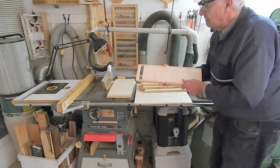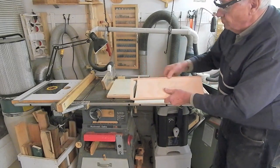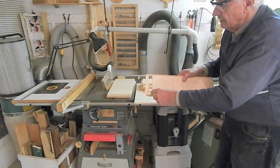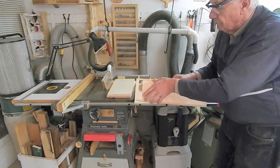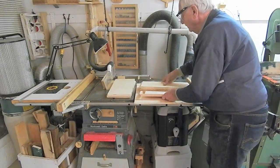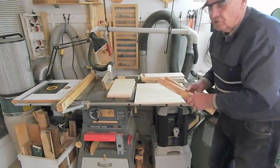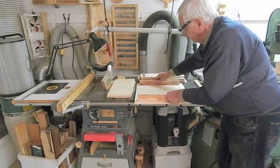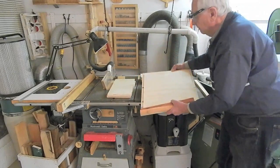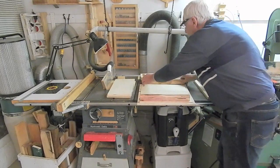Except for the front piece — I had to provide for a slot for the extend-retract lever. So I just used two five-sixteenths hardwood strips above and below, and two pieces for the skirt filler between the hardwood layers. Inside the skirt, front and back, are the pivot blocks — a shorter one for the front to leave room for the extend-retract lever, and the longer one at the rear.